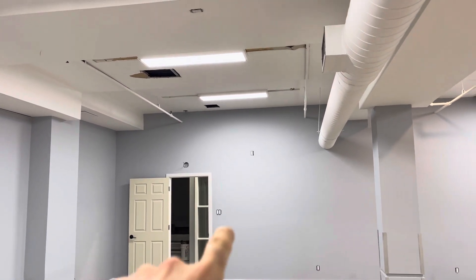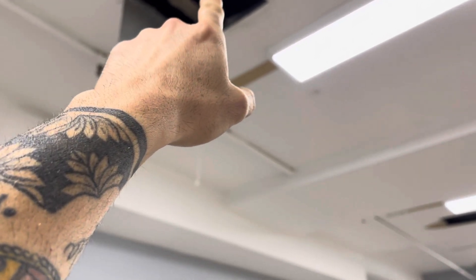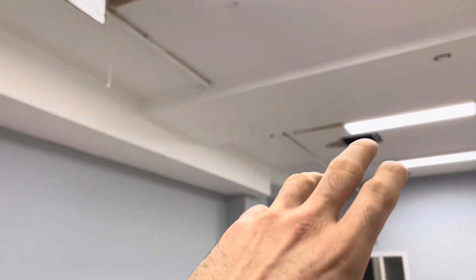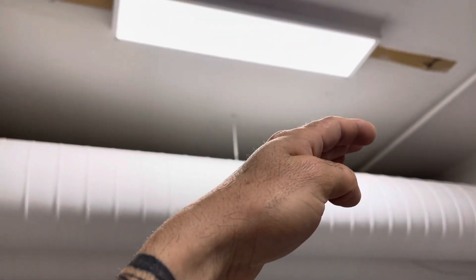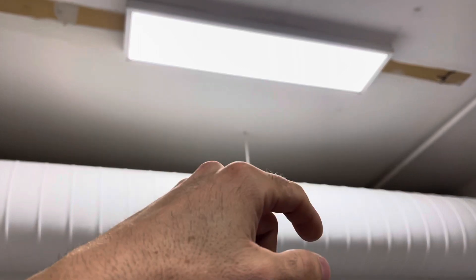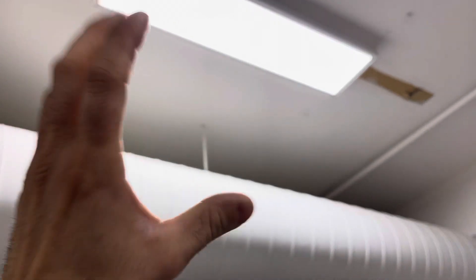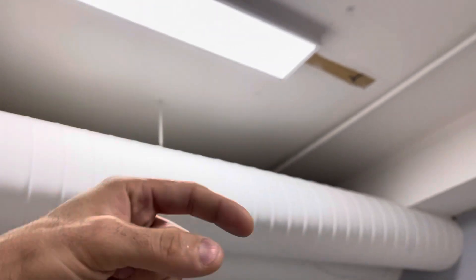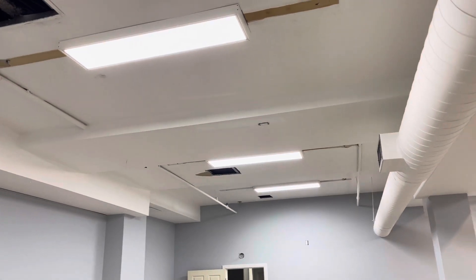Everything works just perfect — I'm super happy. Every connection has to be accessible everywhere, as per safety precautions. We have the connections for the emergency lights over there, and for all this light system and for the outlet, the main connection is in that other trap and inside that light. If you remove the light — which is super easy, it's always easier to remove than to install — inside there you have the 347 volts. This is circuit number seven and number nine; they are in a safe box, because you cannot leave 347 volts in the same box as 120 volts. That's not legal and that's very unsafe. Everything is identified and labeled.